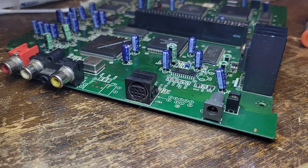I tell you what though, I am super surprised that they managed to cram the Genesis side here with all these integrated custom circuits. And obviously, this is the Genesis side because this is an 8 megahertz version of the 68000. This is the 12 megahertz version. Now, I could have sworn the Sega CD was 12.5. I don't know why it's shown as the FN12, and this is the FN8. That's kind of overclocked, 8 megahertz, because isn't the Genesis like 7.5? But the Sega CD is 12.5, so I don't know if that's underclocked or if it's just not showing what the actual speed is.